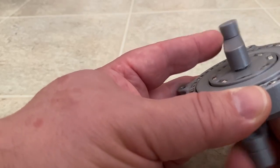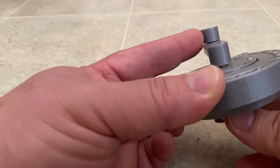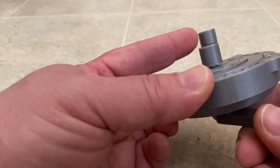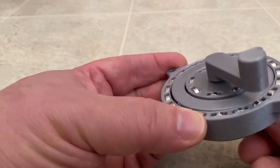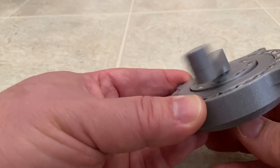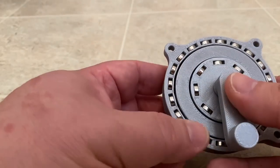What's cool about this is that if something gets in the way, it just keeps skipping the different valleys and goes to the next one. So you don't have gears breaking or chipping. If you have an application where you need gears that don't touch or rub, that's what magnetic gears are really cool for.